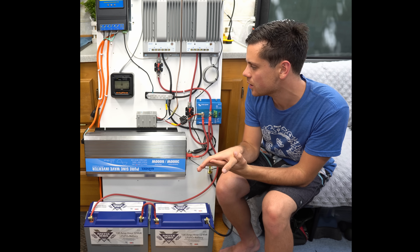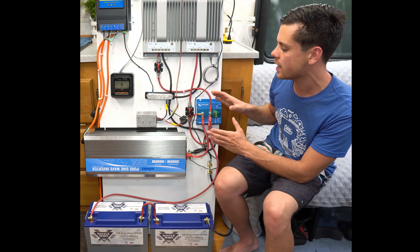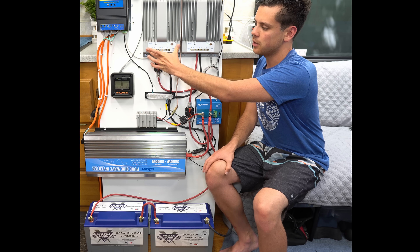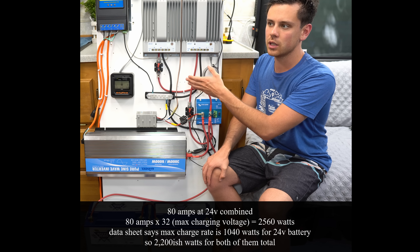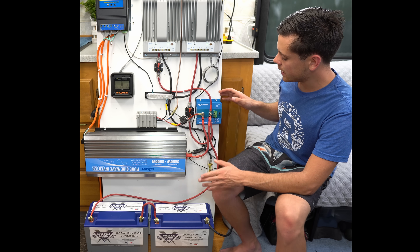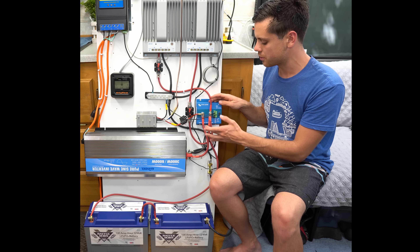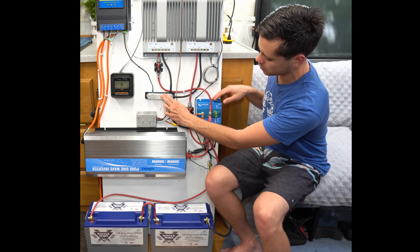It's mostly a very simple system with off-the-shelf components. For me personally, this is going to be my new main system that I can test new components on. I'm only adding 1,200 watts of solar panel input. Even though these can handle 2,000 watts input at a 24-volt battery system, they are only capable of delivering 80 amps at 24 volts — so the charging power will only be 2,200 watts, but it can safely input 4,000 watts total. I've also noticed I love using this for short circuit protection, and using it as a main positive cable distribution spot with all cables attached here.